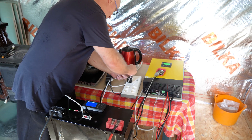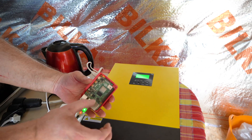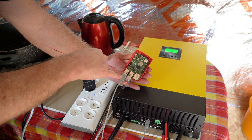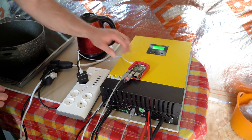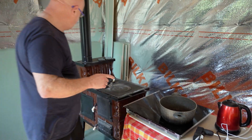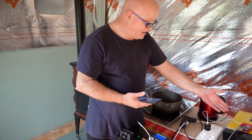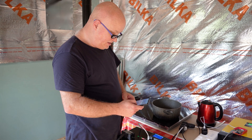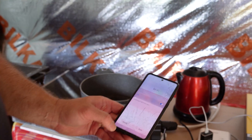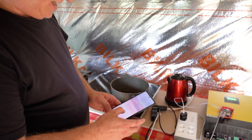This cable plugs in here for the inverter. This is just a normal USB power — we stick that in there. You see these little lights: the red one is a power light, that's a data access light. Now it's showing it's talking to the battery. If we plug this into the internet we can access all this information online, but we don't have internet here at the moment. What's cool is if it doesn't detect an internet signal through the port, it broadcasts its own Wi-Fi connection. I go into my Wi-Fi settings and it comes up as 'Solar Assistant' — this is a third-party piece of software you can buy and set up yourself.